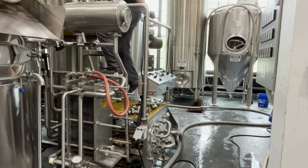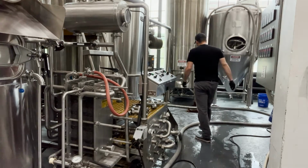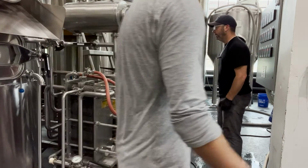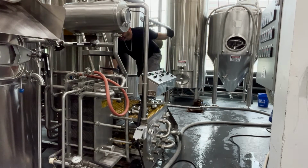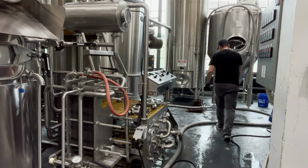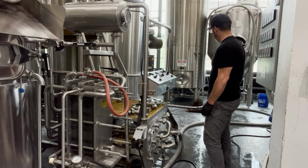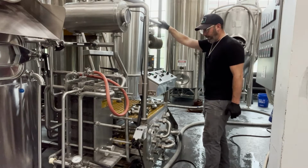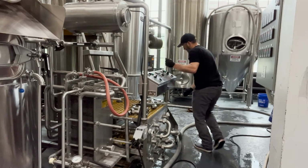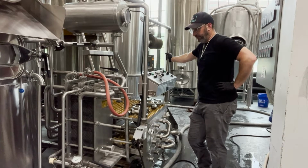we will seal up the top, close my doors, and then all I'm doing right now is just closing the necessary valves and opening up necessary valves to create the CIP loop. And I'm double checking all of that and trying to be careful. Boom. And I think we're ready to rip this thing. For me, I'm gonna run this pump as fast as it goes. Boom. I'm going to verify flow of the liquid here by looking at my sight glass. Oh, my kettle drain needed to be opened. Hopefully that works its way through. Hopefully there wasn't a bubble in there.